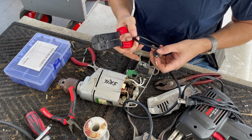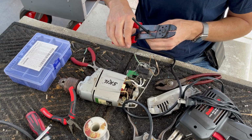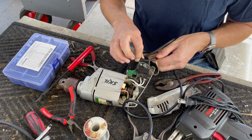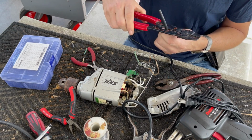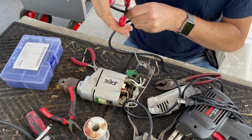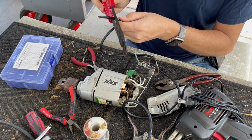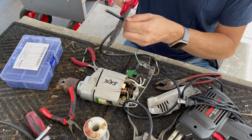Okay, so we've got a wire to here. So I'm gonna need about that much. Maybe less. I mean, realistically, I need to go so very gently. Do not press on here. We're just trying to cut through the outer insulation. So I'm really just spinning it around and letting the stripper blades just cut into the black. I don't want to cut any deeper than that.